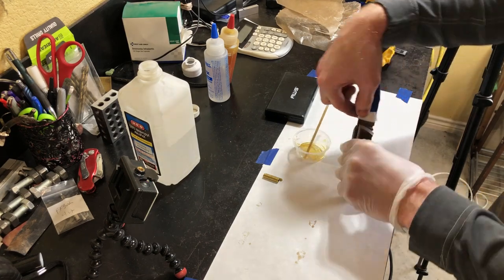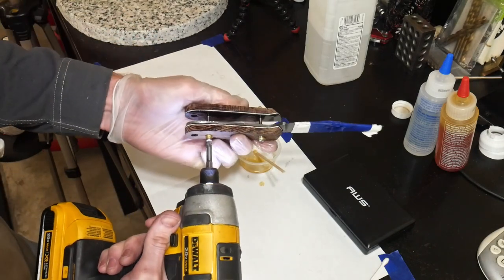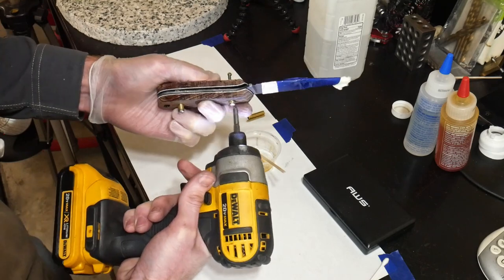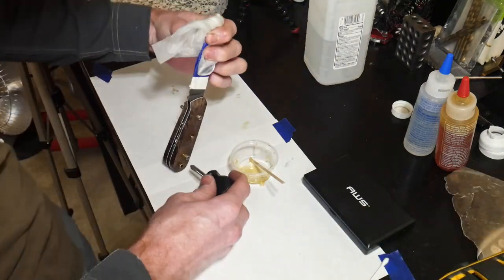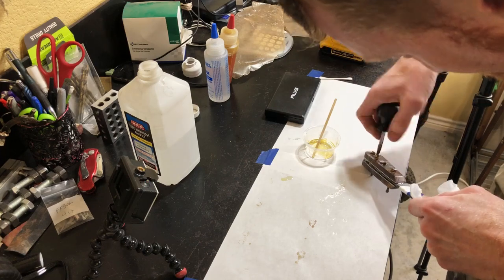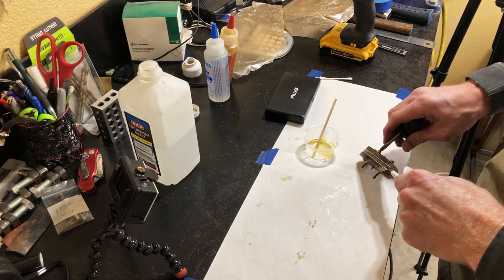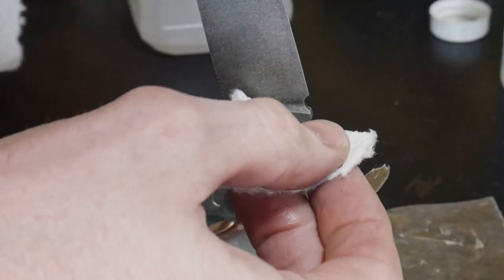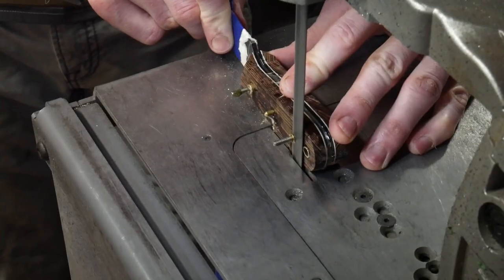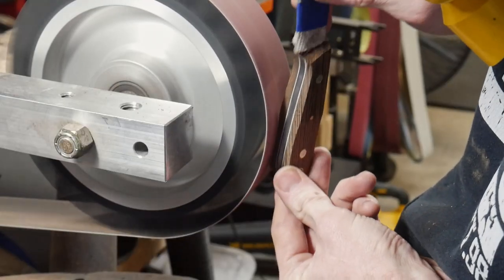After the nuts are installed in all four locations, put a little epoxy onto the knife tang itself and start screwing together the handle. I like using the drill here, however you must be very careful not to over-torque, over-tighten, or break anything. I normally get it very close with the drill and then finish tightening with hand tools. If you have a simpler standard operating procedure for installing Loveless fasteners, please share it in the comments. Once the fasteners are gently snugged up — but not so tight as to force all the epoxy out — clean off the front of the handle scales and allow 24 hours for the epoxy to cure.